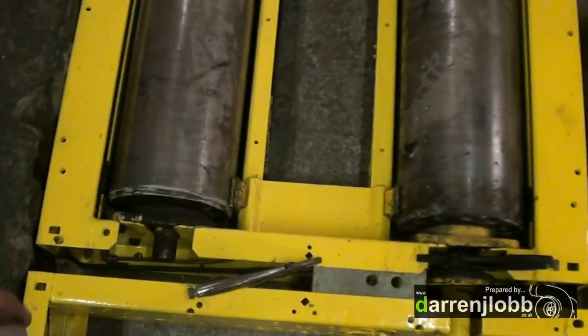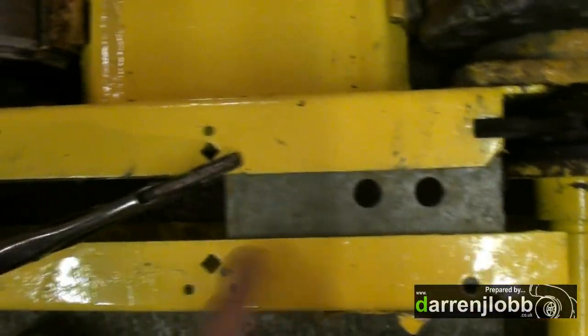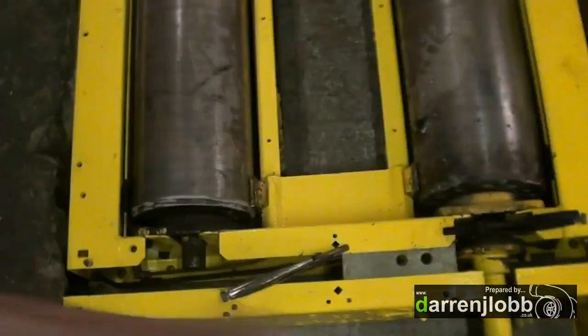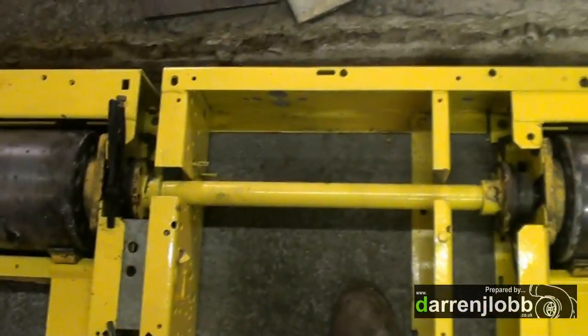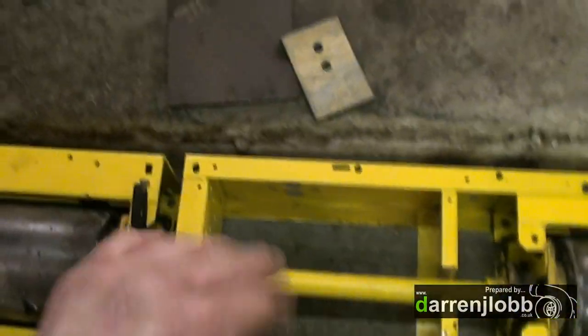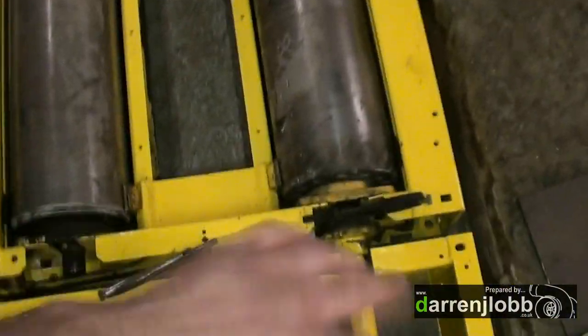I just wanted to make something so they're actually linked physically. I've got these two big plates — I'll put one there, one there, and drill three holes in each side just to bolt the two units together to make sure it's fixed. Because if this starts moving independently it puts massive strain on that shaft. The grease joints give a slight play so you haven't got to get it absolutely bang on, but I've actually made sure it is bang on.